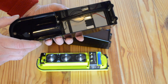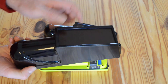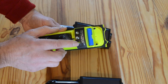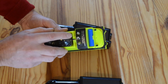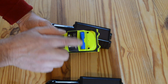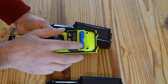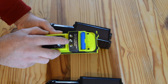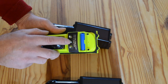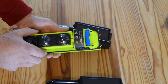In the back of the cover you have two contacts from the solar panel which connect to two little spring-loaded contacts — positive and negative. These keep the solar panel charging the battery. There is also a tamper switch, a little spring switch. If the cover is removed, that tamper switch would operate and the alarm would go off.